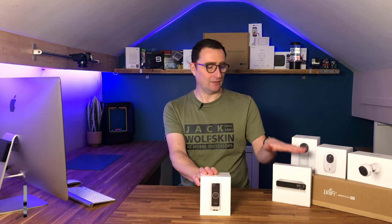This doorbell is not PoE powered — you have to power it via a transformer. If you've got a transformer already installed at your property it's a great addition, but be aware you can't just connect it to the transformer without something to control the doorbell. If you're already invested with cameras powered by a PoE switch, you just add this with the supplied transformer. It retails for about £200, but you will almost certainly need a Cloud Key Gen 2 Plus on your network to adopt it. I'll be going into detail showing how to adopt it into the Protect environment and looking at picture quality.